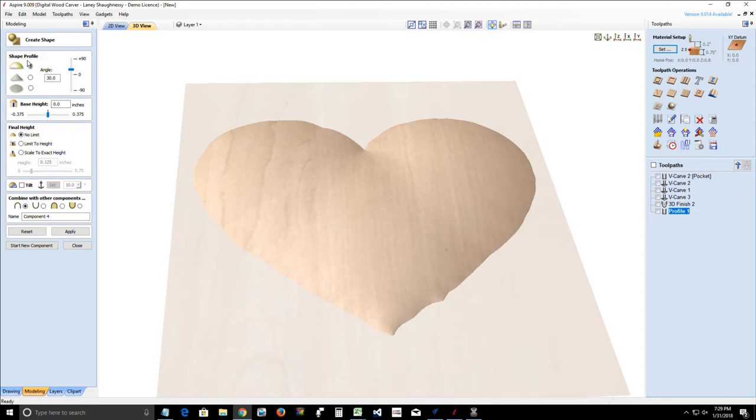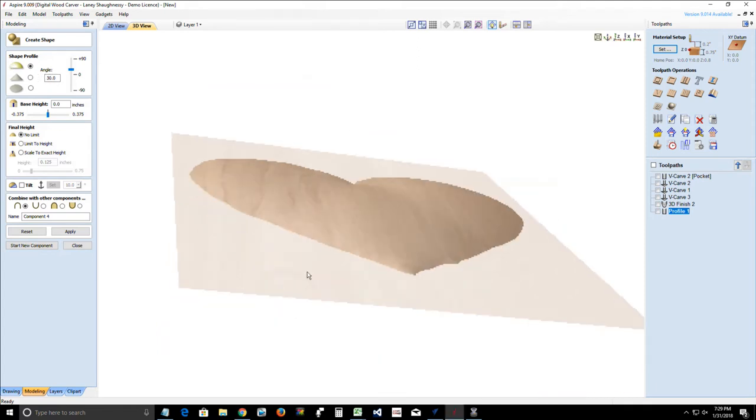So again, the shape, that 30 degree angle shape, if you look at it here, we just have a nice flat shape that's bubbled that curve up 30 degrees. Well, I need to build some meat underneath that, and that's where the base height comes in. So if I change this to a quarter of an inch base height and click apply,